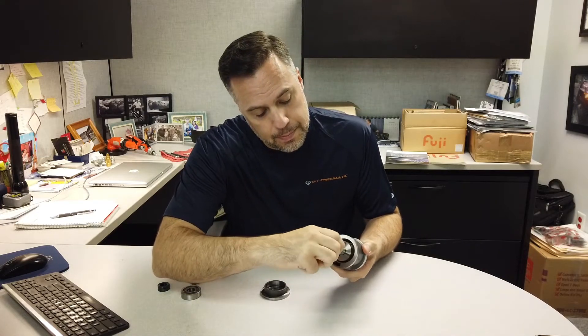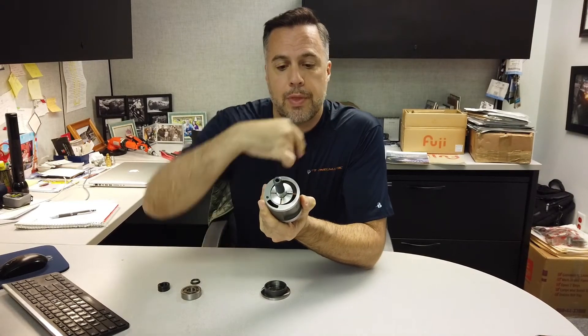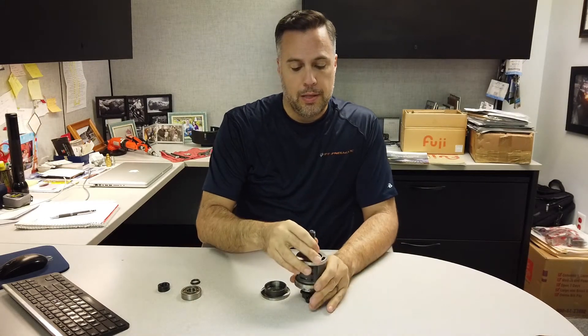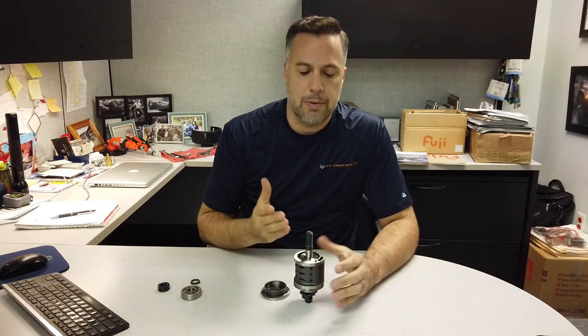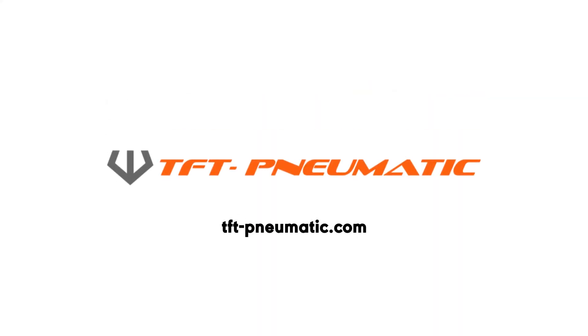As the air tool spins, the rubber blades come out and as they come out they push the air. Think of it as a propeller in a boat. As the air gets pushed through you develop power, and then with that power you transmit it through the spindle and onto whatever grinding disk you may be using.